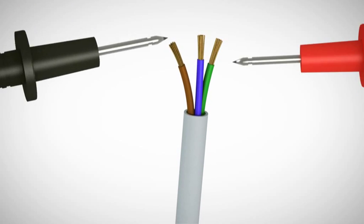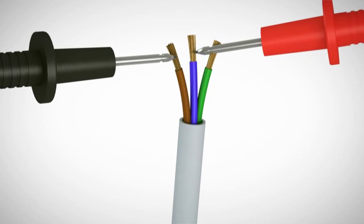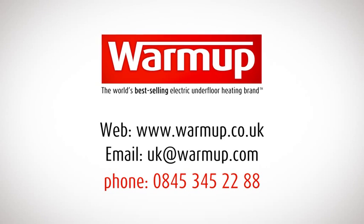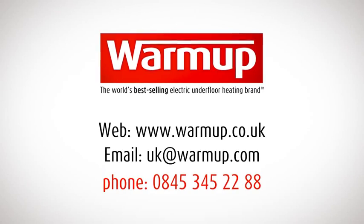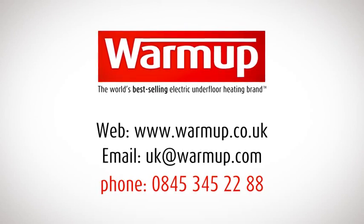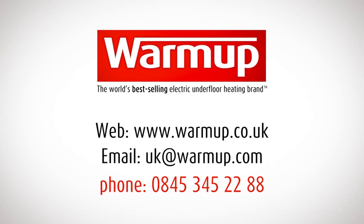At this stage, you should perform another multimeter test on the heater and make a note of the reading in the WarmUp installation manual. If you have any questions at any point, simply call the 24-hour WarmUp technical helpline. Our helpful experts are on hand to guide you through every step of your project.